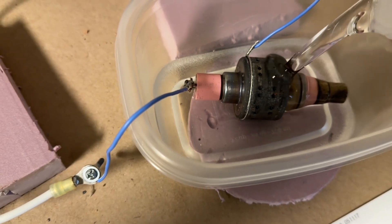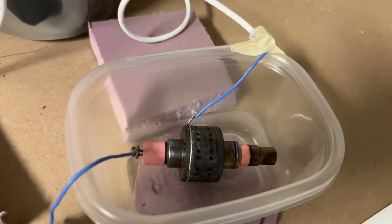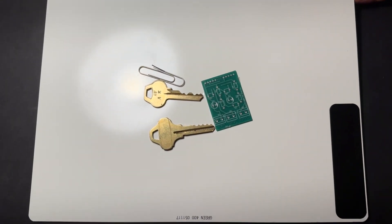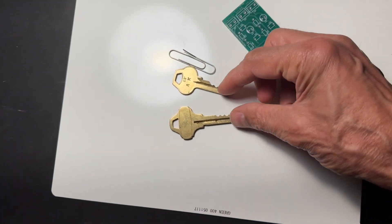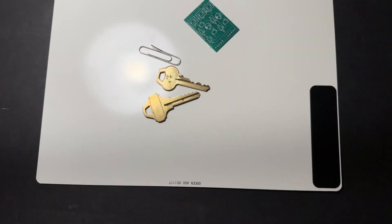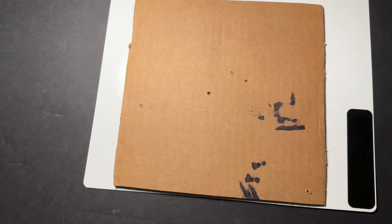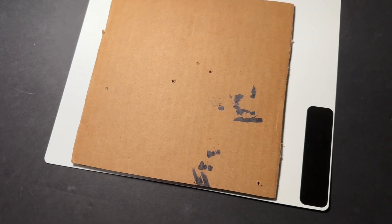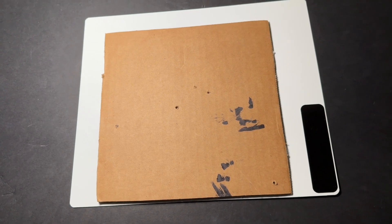This is just regular mineral oil — I'm going to fill it up so it covers the connections. The purpose of the oil is to prevent short-circuiting across the ceramic. Our green fluorescent screen fluoresces green, which is why they call it green screen material. The objects are radio-opaque, including a circuit board, some keys, a paper clip, etc. We're going to cover that with cardboard facing down over the magnetron tube so that any light generated by the tube from sparking or fluorescence of the ceramic will not shine through and expose the objects — that way we know it's x-rays causing the fluorescence and not visible light.